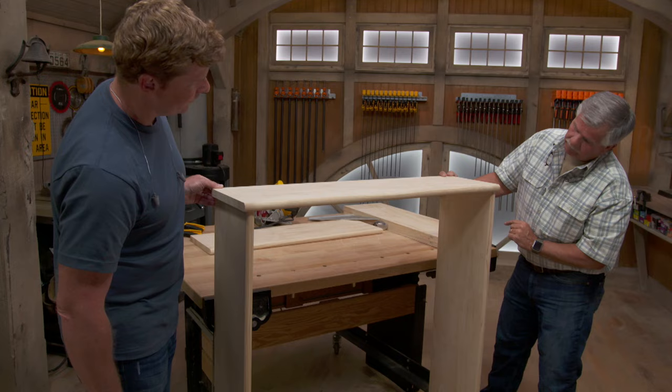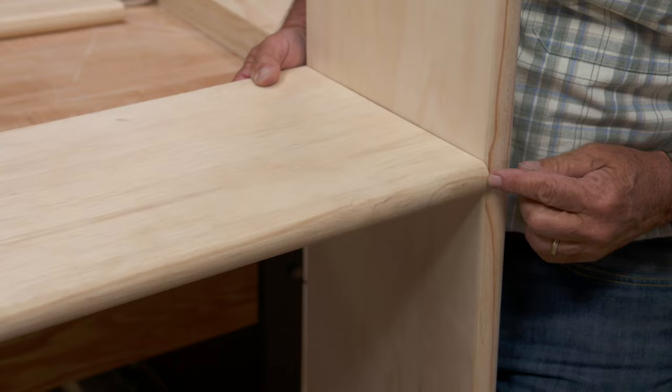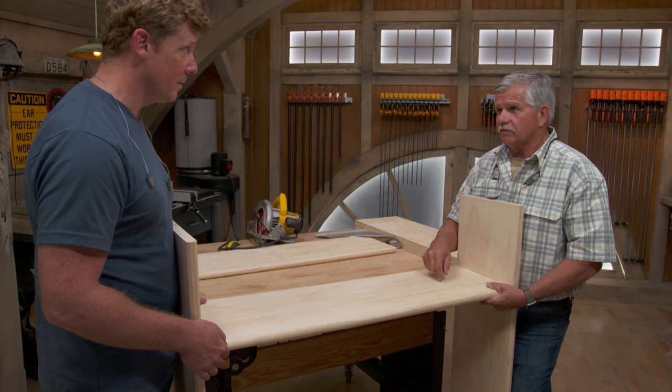So we've got to rip these sides? I want to rip the sides three-quarters of an inch. Now we'll take this board and slide it down, use it like a shelf, hold it even on the back — and we end up with the same problem: an ugly joint. What I want to do is slide this back a half an inch. But I also have to allow for the thickness of the back, which is a quarter of an inch. So half an inch plus a quarter is three-quarters. So we've got to take three-quarters off of this, but another three-quarters so that they match the sides. So we'll take an inch and a half off the shelf and three-quarters of an inch off each side.